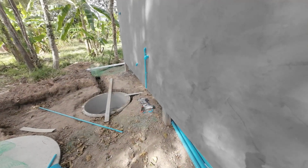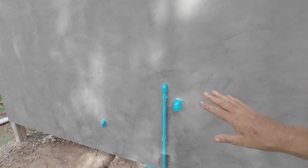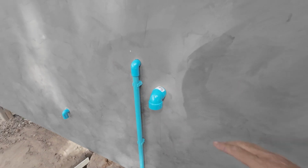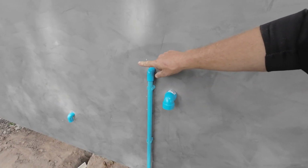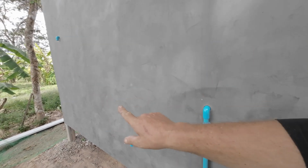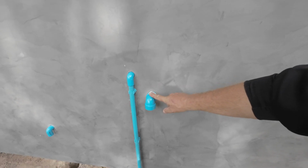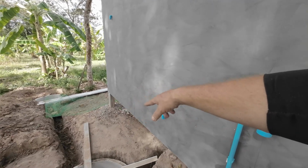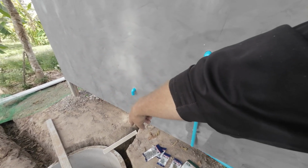Okay, so now on to the plumbing for this. Actually we come out through the wall on this one, but it'll be nice and neat when it's all done. So here we have 1.25 inch. This one is actually 18 mil for your taps. So this is for the waste for the hand basin that comes down, but for the bottom of the shower, that'll be 2 inch. So this will go down to 1.25 inch over to 2 inch, then out down here.